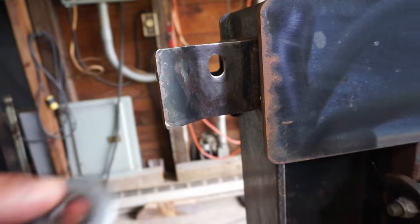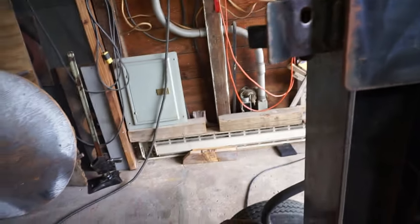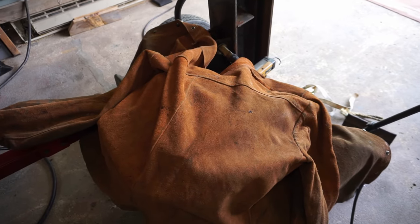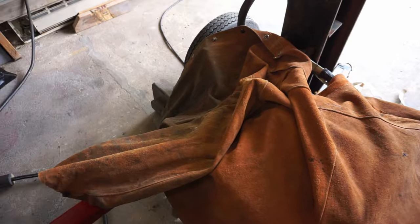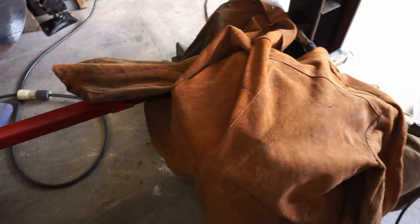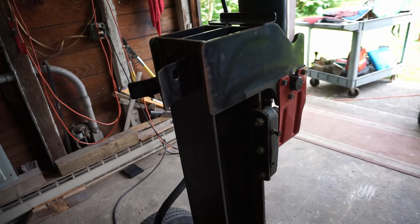Wire wheeled it and used the belt sander - you can't have any of the plating or anything. Also wash it with a degreaser. This is an old leather jacket I found at a garage sale - it's a welder's jacket but it was disgusting, green and black mold. I got a lot of the mold off - I got a new jacket but I've had this for years. It's perfect as a welding blanket. I'm going to put it down, line it up, clamp it in, tack it, bring it back upright. I've got other things to do - finish the welding and we're done with the welder.